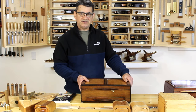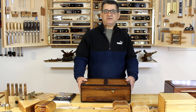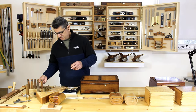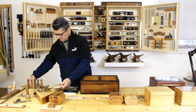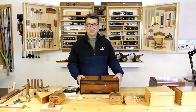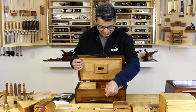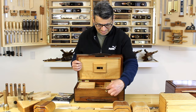It's a little larger, with larger compartments above and the bottom drawer with a contrasting interior and engraved brass plate. I was marketing these for close to $800-900 at the time, about 24 years ago - probably $1,500-1,600 in today's money. They took considerable time to create, working in small batches. I used templates for quadrant hinges. The earlier boxes were mostly created using machines like routers with very little hand work, but the later ones I progressed to using hand tools. Installing a brass lock in a jewelry box is pretty scary - creating that mortise and matching it with the key opening.